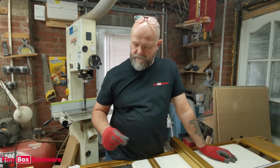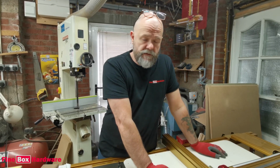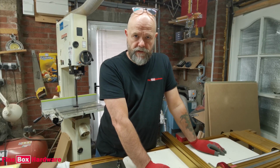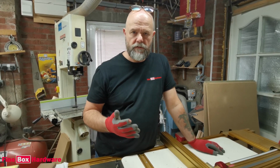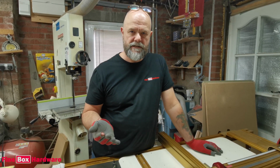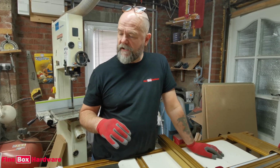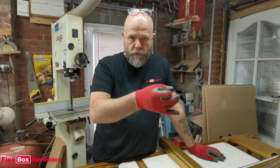I'm sure a lot of you for years have used the wooden block on both sides, and maybe been a bit confused why you're possibly getting some misalignment. Climb cutting one way, normal cutting the other way, produces two different cuts. It's very small amounts, but we all know that it's enough to throw the box off. And of course, it's not nice. Everybody wants perfect alignment. That's pretty much going to be unachievable, but you'll get very good alignment, and then we can fine tune the alignment, because again, measuring is as accurate as I'm holding it.